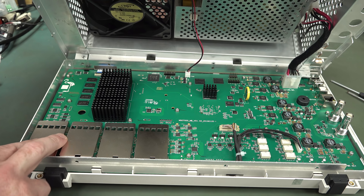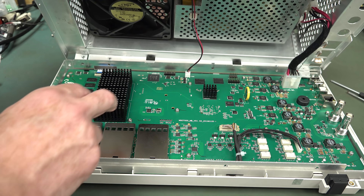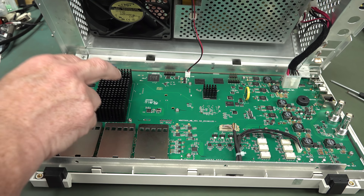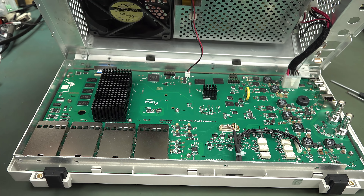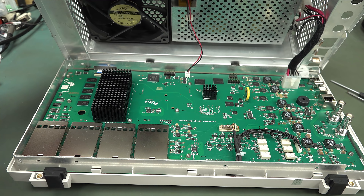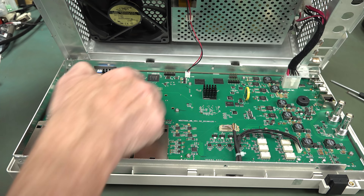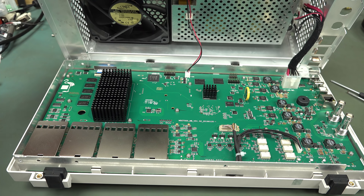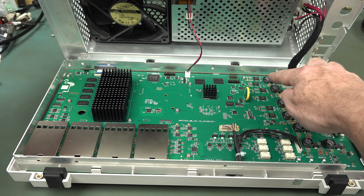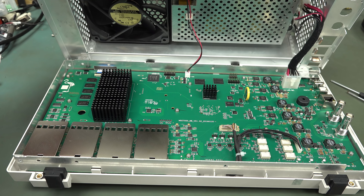The power supply is mounted on the back, and there's a big-ass fan — it's absolutely massive; bigger could potentially be quieter since you can move a greater volume of air at lower RPM. And we're in! There are our four analog front ends — nicely shielded with what look like nickel screening cans. We've got two big custom ASICs up here, our ADCs and sampling engines — the new Phoenix chipset. Got some old-school relays, a battery, and a little Spartan 6 FPGA. There's our sample memory.